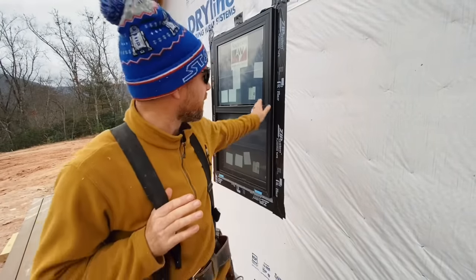So that's ten steps for putting in a window typically. Like I said, read your instructions because there may be many more steps if you're installing wood windows or super expensive windows with super good warranties - if you skip those steps, you could void your warranties. Word to the wise: read all the fine print on your paperwork with your windows. A couple of final notes: we leave this plastic film on the windows until the house is done so that paint, dust, or scratches don't get on the windows. After the windows are installed, this company recommends shimming permanent shims around the inside of the frame to the framing. And you want to seal the entire perimeter around the inside with low expansion foam, or you can use backer rod and caulk, so that the entire perimeter is sealed for insulation and air movement. Thanks for watching - remember to subscribe to our channel and click the bell for future videos.